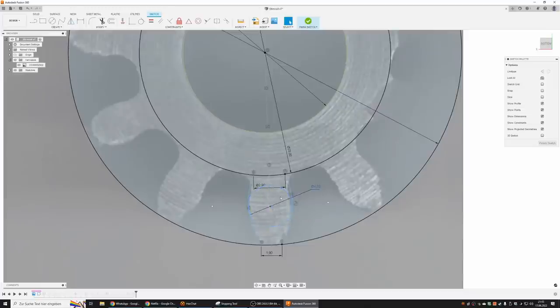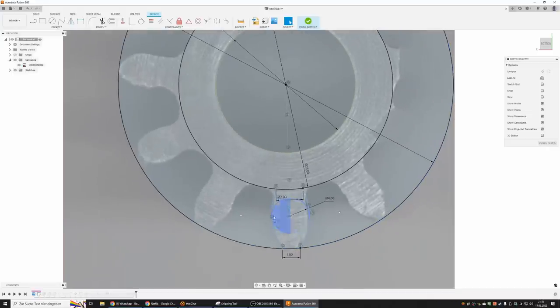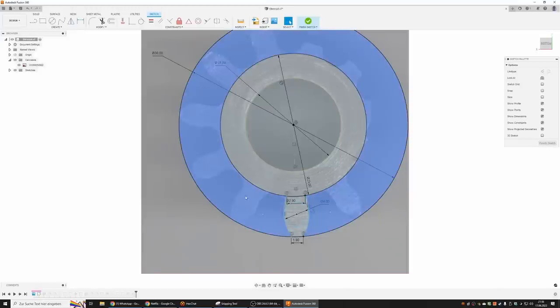and then create a sketch of one of the teeth. I could measure the thickness of the tooth with calipers. This is this diameter here, diameter 4. That's what I measured off the gear. And I could kind of approximate the width on the foot of the tooth. And I could also measure up here the 1.9 millimeter diameter, also just with calipers. Then I just pulled an arc, didn't really do an involute construction since it's a fairly coarse application.